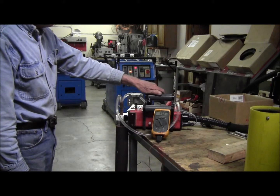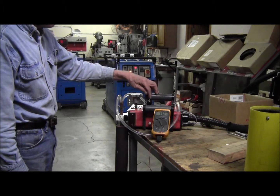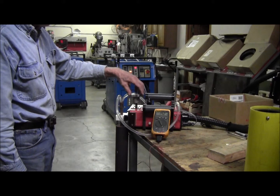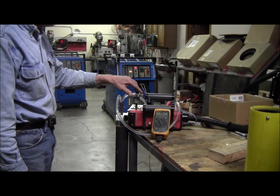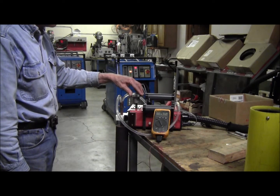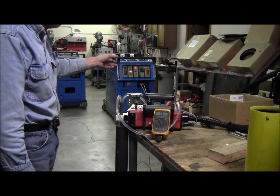This is the hand unit. It weighs about five to six kilos, has two handles, has a power switch, has an LED, and has a quick disconnect knob so you can remove the heating coil very easily. That's oftentimes very convenient when you're doing a large number of bolts. I'm going to walk over to the machine and turn on the fan and the pump.